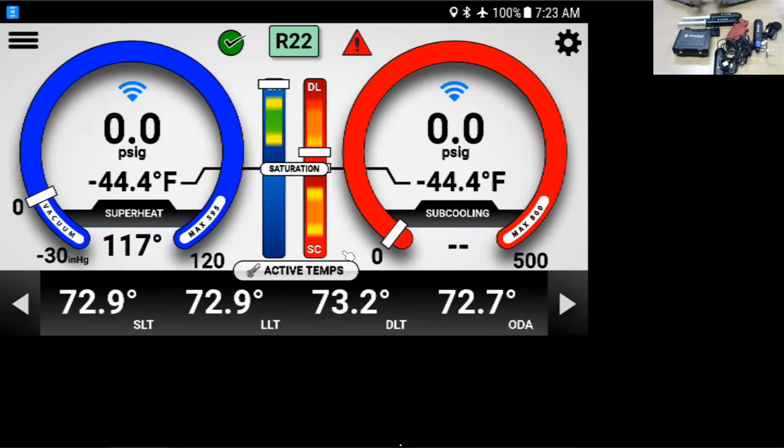At this point, I'd like to, again, throw it out there for questions. Nick, has anything come up that we need to address on the feed here? Just right now, just one questioning whether there was a specific high side pressure probe and low side pressure probe. And there are, one is signified with the red tip and one has the blue tip. And those come with the T's and the 6-inch hoses. So you are ready to go hook up to a system. If you had to add refrigerant or recover refrigerant, you can do it right through those T's. That just kind of eliminates the need for the manifold itself. That's what a lot of guys are really liking about it. But I think that was the only question I've seen so far.